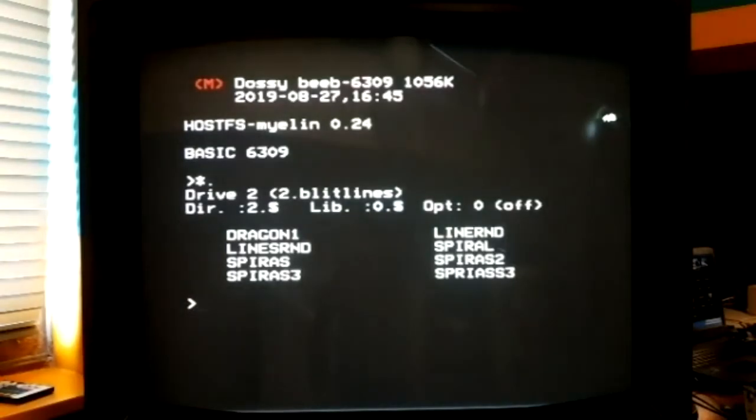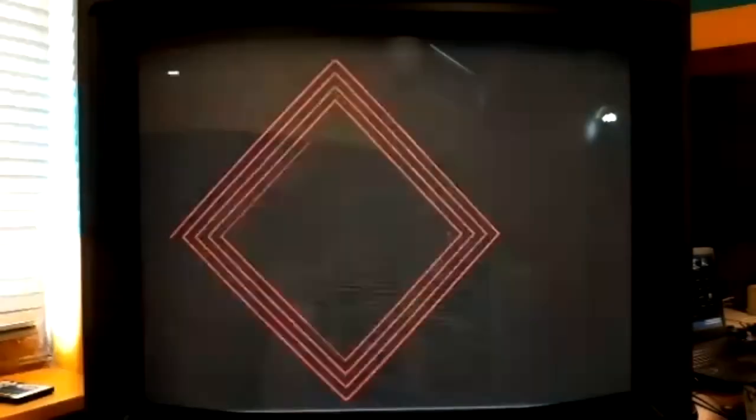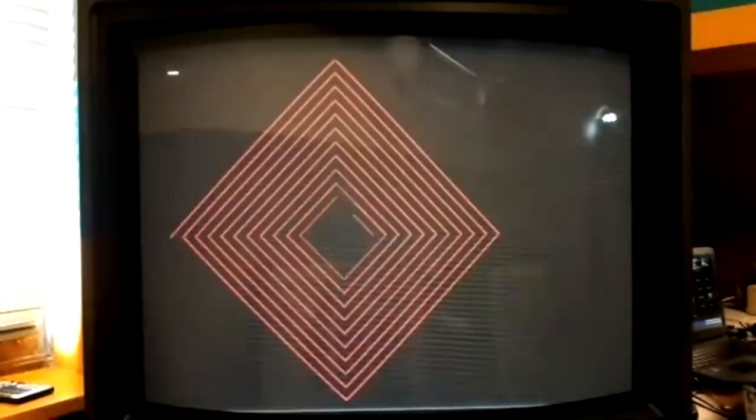The next thing that a lot of the graphics accelerators do is taking over the plot code. So this has got a hacked MOS in it, which instead of using its own plot routines, uses the hardware acceleration of the blitter to do some line plotting. I'll try and load the right program. So here's a really quick and simple test program.